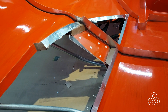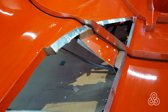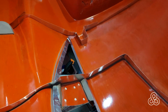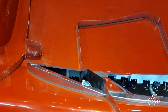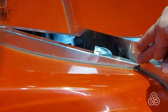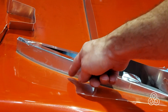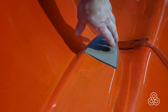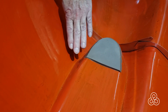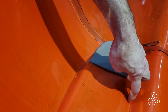The plexiglass is actually taking the place of where the window itself will be, and I've got clay on both sides to occupy the space where we'll have a cavity where that channel will slide in behind that glass. That back little quarter upper window starts at the three-eighths channel, but then it's going to go in — that window will actually be recessed more into the vehicle, and on the top where we've got this room, there'll be a vent for cabin venting. These little pieces of clay are just to make a recess — there'll be a piece of panel that extends to take this duct back into the engine compartment, and this area will all be cut out as part of the vent.